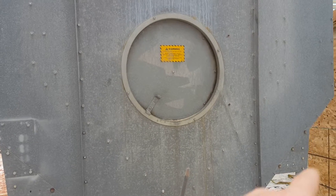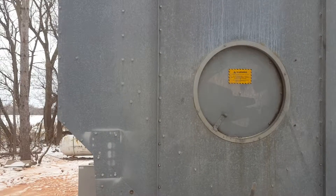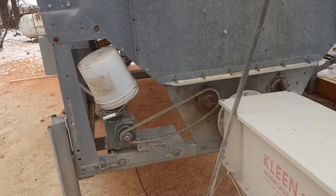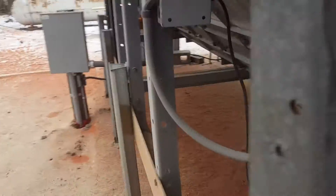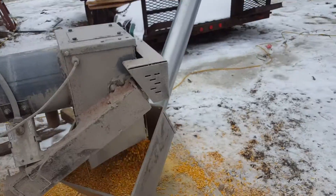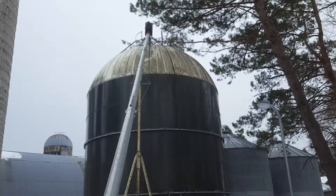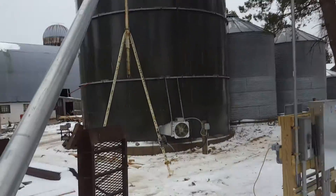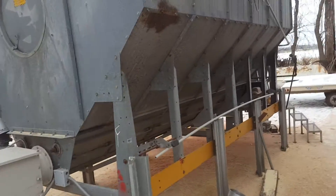From those two little upright angles around that door, that's all empty, and the air is getting blown out from there through that corn. You can see the little meter — this little chain runs the metering roll at the bottom of the dryer, and that's where the corn is going. It comes out here, runs through a moisture sensor, and then up — 60 feet up this little auger to that bin. Right now it's doing about a half a semi, or a little better, an hour.